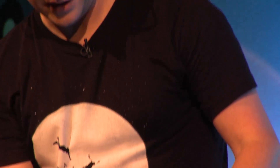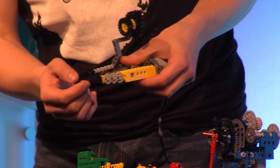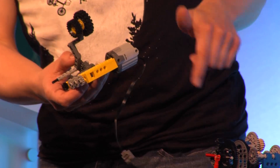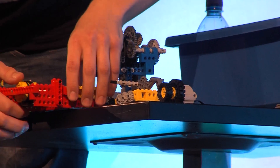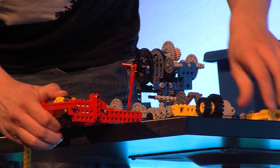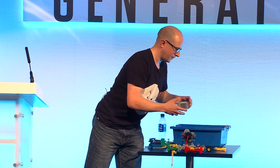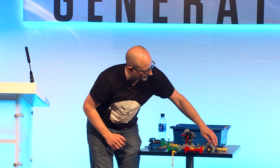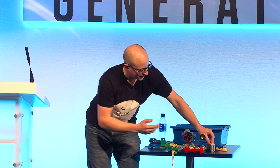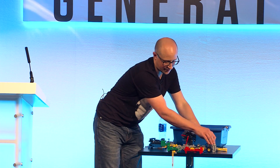It was that initial process of exploration and playfully getting into things that really opened up my mind. I realized that by using differential gears, I could create a mechanism that swings over, connects this to the clock whilst locking the rest of the clock off. So I can plug this in and you'll see it working in action. When I rewind it, the beam pops up, it's locked off the clock, and now it's pulling the weight up for me. To reset it, flick it back, and it goes.